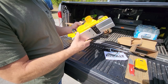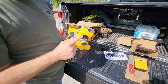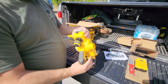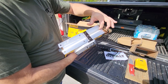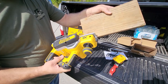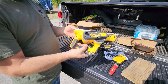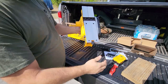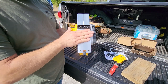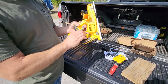You can lock and unlock your blades, and here's where you adjust your depth by turning this dial to set how deep you want it. It has a chamfer groove in there so you can run it right along the edge of a piece of wood. Other than that it's pretty simple - it's got a nice machined surface on here so it'll go smooth across and give you a nice level result. It also has the tool built into the handle, like a lot of the DeWalt tools do.